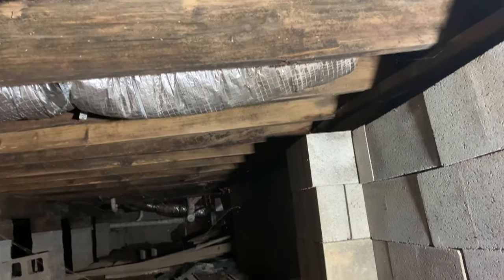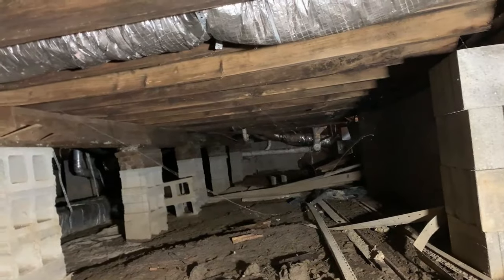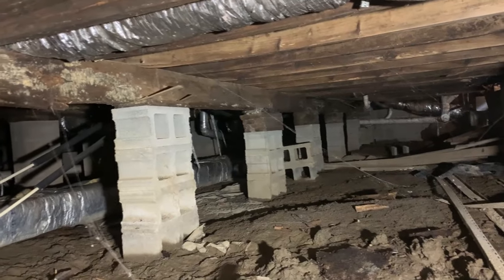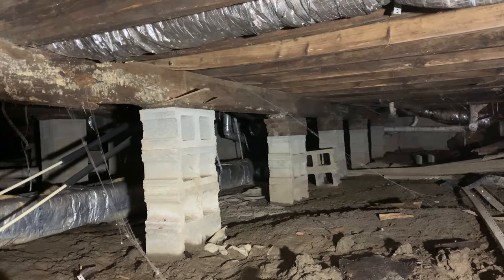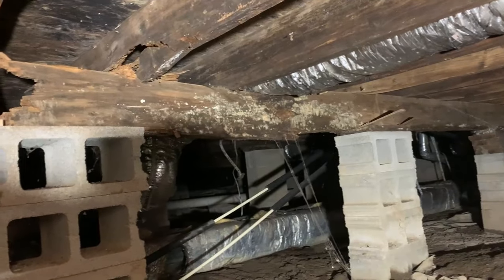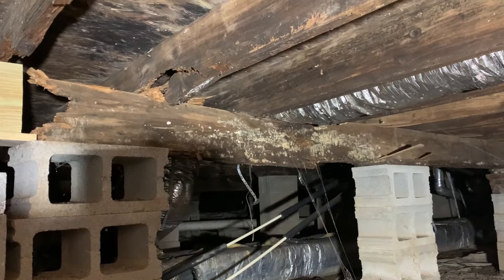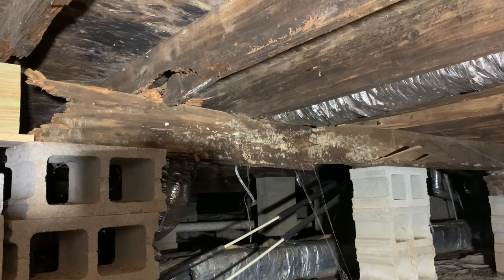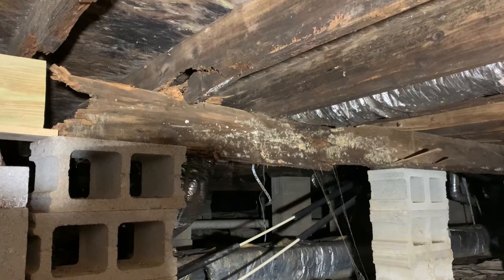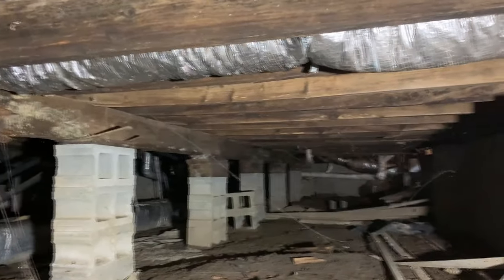The far end down there was a bathroom — you can see the pipes. And then over that way you see the actual columns, about eight feet in from the outside edge. Those are for the girder beam, which, if you look over here, the girder beam is trash, as well as the joist itself in that area. They've completely rotted — the center girder as well as the one on the opposite side of the house.